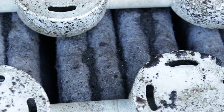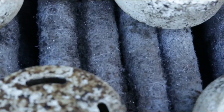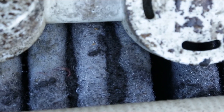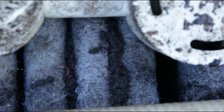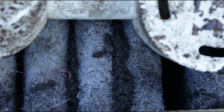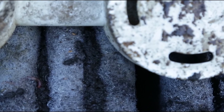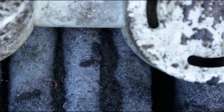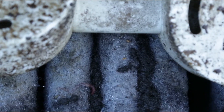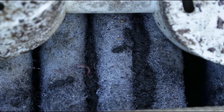On this same system with the lid problem, you can see worm castings in between the sheets. There may be a worm issue — you can see down in the media some black-looking dirt deposited by worms, which can accumulate in the sheets. Usually it's not a major issue, and a lot of times we'll just spray it down when we're out here. But if it accumulates badly, you can add a pesticide to kill the worms over the top of the media. If you find one that's really bad, consult the factory or RC Worst and Company for direction.